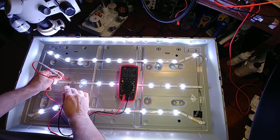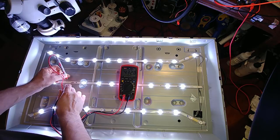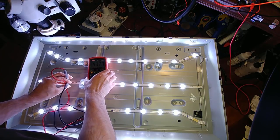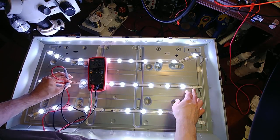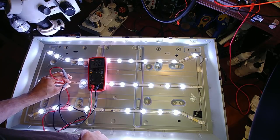I'll have to use my highest current-rated LEDs to replace these. Having so many failed LEDs could be affecting the current — if it's not a well put-together power supply it should regulate the current, but we have many failed LEDs so we'll just have to see.